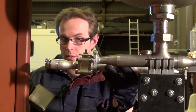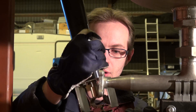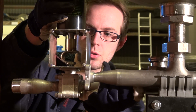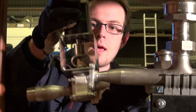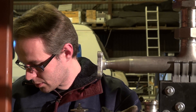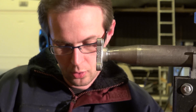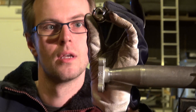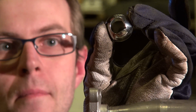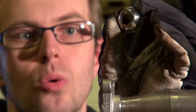On top of the other tank will be fitted this DC servo that will, from Scott's computer, turn the valve and open to the engine. The valve here is not a standard valve — the ball inside the valve is a V-groove ball. You can see it's cut into a V, so it's not a round opening, and thereby you can control the flow better.